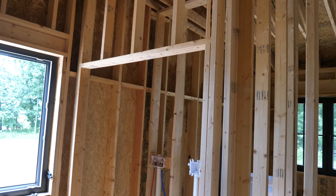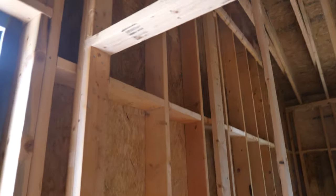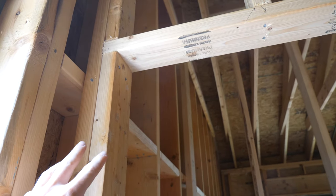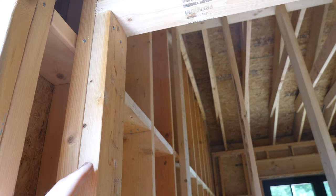The first order of business is this laundry nook. We have to make some minor changes to this door. When we were planning this out in Chief Architect, we forgot to leave this jamb out wide enough for our trim. This is only two-by thickness — that's only three inches thick. We'll have a three-and-a-half inch trim detail, so we might be able to fit it once the door jambs are here, but it's going to look really weird right up against this wall.